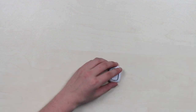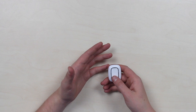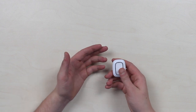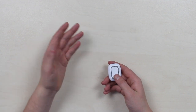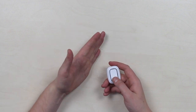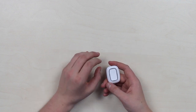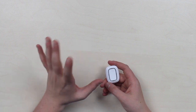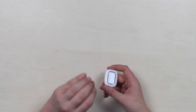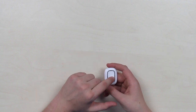The Ajax Button is a very simple but sometimes highly essential device — you press it and the alarm is on. Used with cashiers, in homes, and many other situations. It provides 1,300 meters of wireless signal transmission over radio waves, the signal is transmitted in under 15 milliseconds, and the battery lasts up to five years.